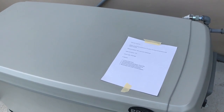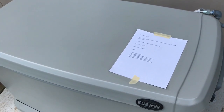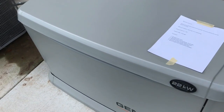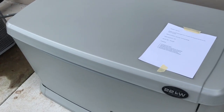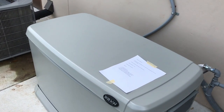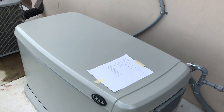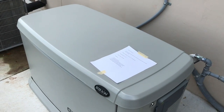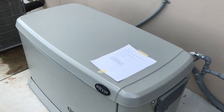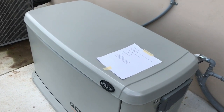Generators are helpful but they don't always produce what experts call clean electricity — meaning it's not that perfect sine wave power you're accustomed to getting in your home. Some of your more sensitive electronics can be damaged when the generator cuts on. So I've put all of our sensitive computers, security system, and home entertainment system on an uninterruptible power supply — a UPS. Even if the generator doesn't come on right away, those systems can stay energized for about an hour, and the UPS provides clean power even while the generator is running.